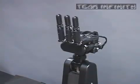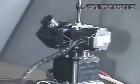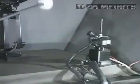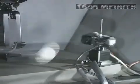The hand can close the joints at 180 degrees in a tenth of a second. The vision system consists of 128 by 128 photo detectors and an all-pixel parallel processing array. Using the vision chip enables various image features to be computed within one millisecond.